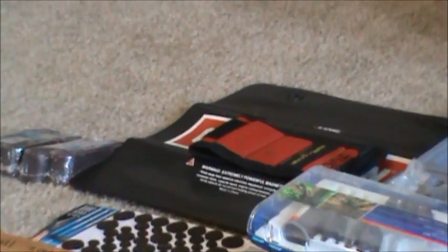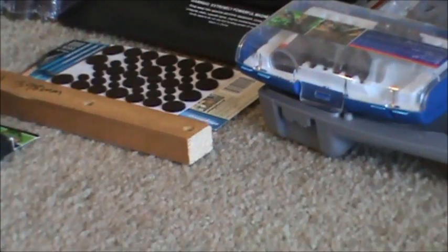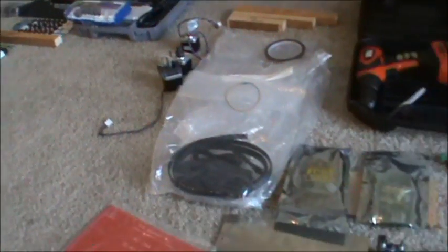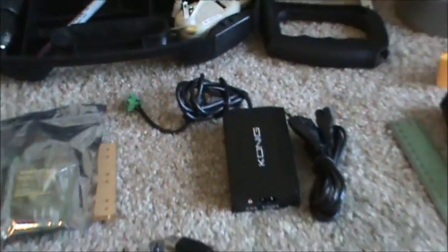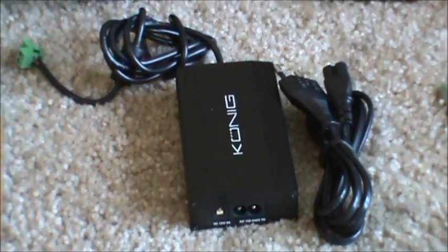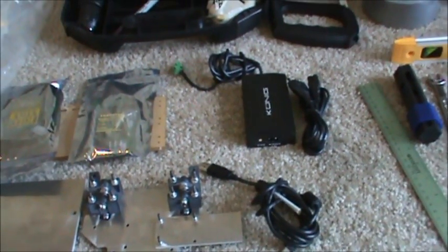Some other suggested hardware: I have a magnetic wrist guard right there and a magnetic plate or pad to work on top of — it keeps me from losing any nuts or bolts. Also forgot to mention: USB. You'll need a USB cable — standard printer type — and a power supply. If you order it from Mendelparts, the supply is European, so all you need is another cord that matches that. I used one from my PS3 and it worked just fine.